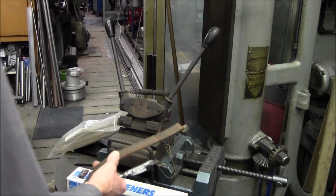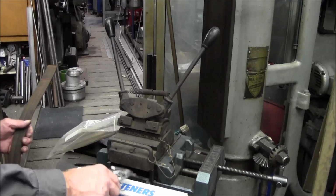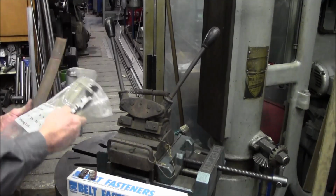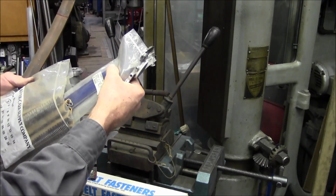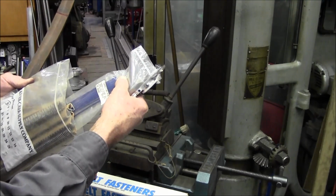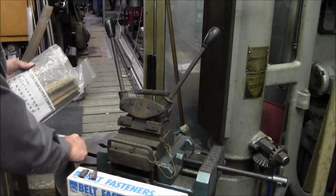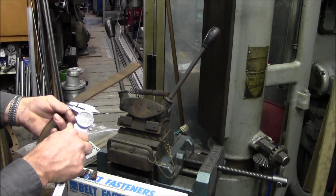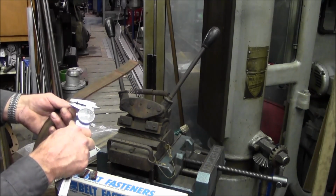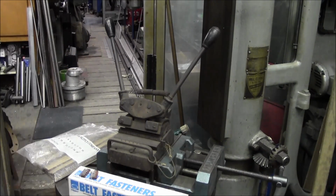So we're going to go ahead and run a number 3 clipper lacing on that, and that's the one we have in the box here. This is our number 4, and I don't know, it says 93 thousandths on the pin material there. The old pin measures out at 95. All right, and very little wear on there.